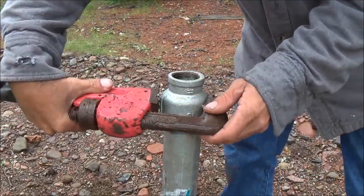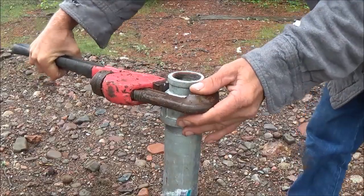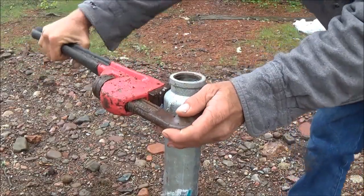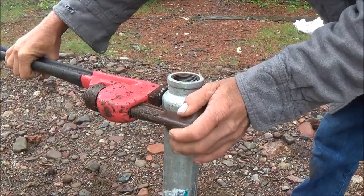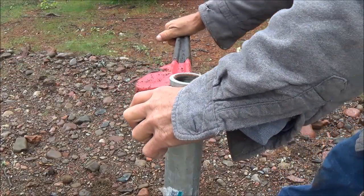I had to put this piece on right here because I've got a 2-inch pipe, but the pitcher-type wells have an inch and a quarter inlet. By putting a 2-inch in, if I want to, I can drop a windmill-type pump well down here, and it all fits inside of a 2-inch pipe.